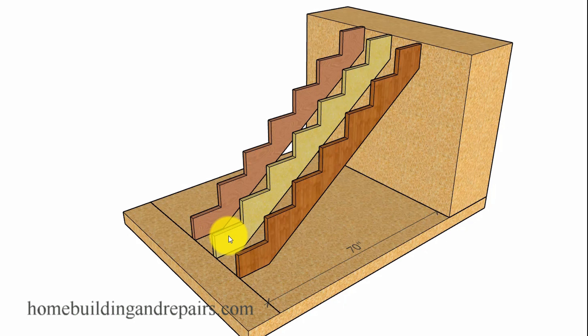In this video I'm going to provide you with an example of what your stair stringers could look like if they were off by as little as a sixteenth of an inch per riser. Let's say you figure out the total rise — the height between floors — do the math, come up with a fraction, and round it off to an eighth of an inch when you should have rounded it to a sixteenth. Hopefully this will make more sense of what actually happens to the stairway by the time you're done with the video.